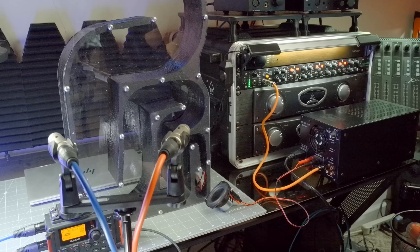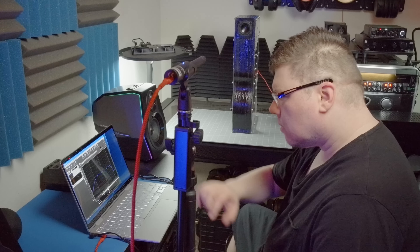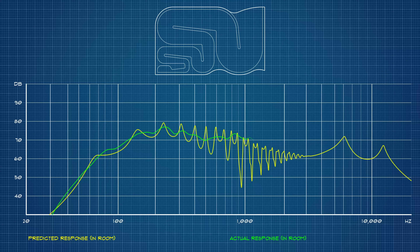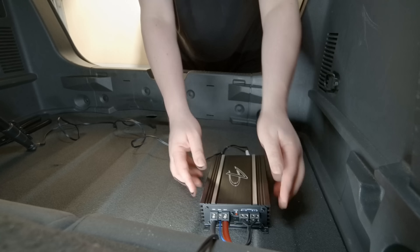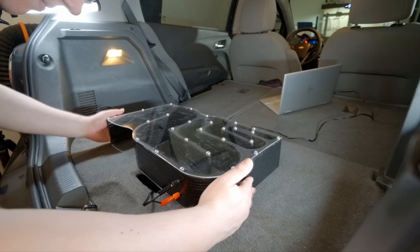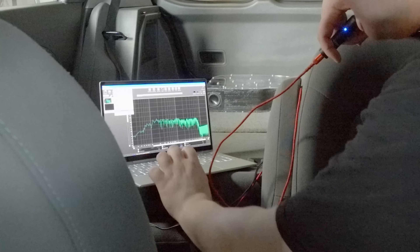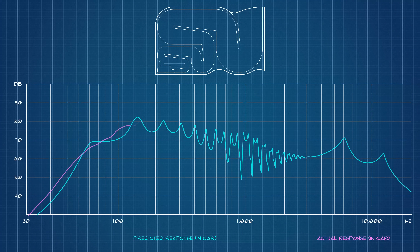Let's see if it works. Now let's get the drivers in the right way around and get to some actual testing. Here's the in-room frequency sweep — no major surprises; the psychoacoustically smooth response correlates well into the upper midrange. For the in-car test, I set up an MK300.2 from Audio Dynamics which, despite its miniature size, can deliver nearly 400 watts of clean power into a 4-ohm load, though today we'll only need about 2% of it. Strictly speaking, 60Hz is the threshold for sub-bass, and as predicted, this thing retains at least a modicum of presence down into the mid-50s.